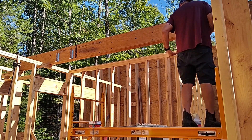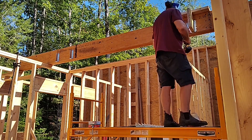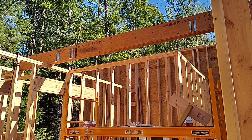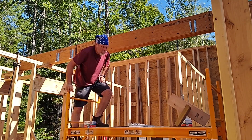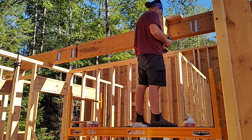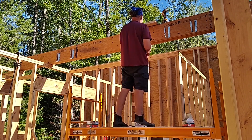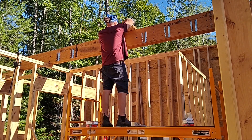The plans originally called for two-by-twelve joists on the other side of this LVL going to the far wall as well. I'm actually going to go with two-by-tens instead because we're never really going to walk out there. There's going to be one small storage area on that side of the LVL, but the entire loft and walking section of the house is on the side I'm standing now. So two-by-twelves on this side, two-by-tens on the other — a little bit of a change to the plans, but certainly sufficient for what we need.